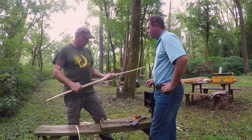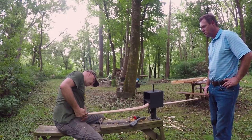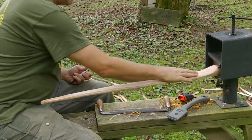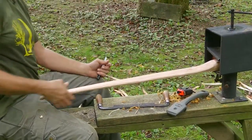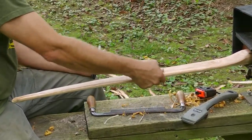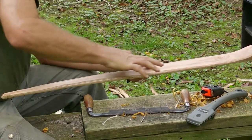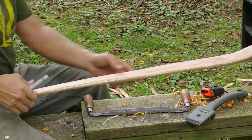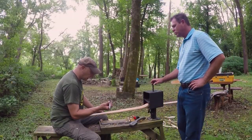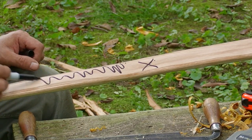I use fast flight strings and that helps to increase the longevity of the tips. Now I'm trying to get the limbs even and I use the stave press. I'll flex the limb and look at how things are moving. It's moving pretty evenly — still a little stiff up here by the fades. You run your hand down the wood, feel the thicknesses, and you can feel a thin spot right here. That could develop into a hinge — it bends more there than anywhere else. I want to remove a little wood from everywhere else but leave that area alone.